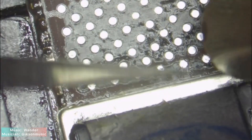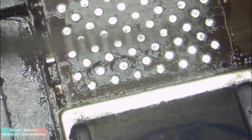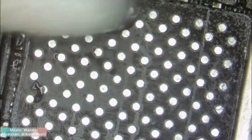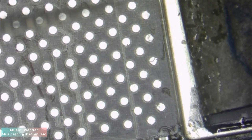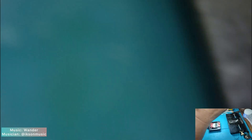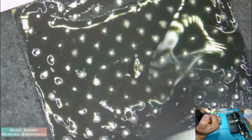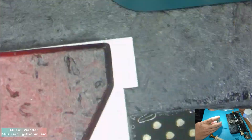Remove the black adhesive to prevent lost connection after binding them together. After cleaning, let's do the same process on the NAND — remove the NAND bonding pad and reball after cleaning.